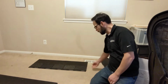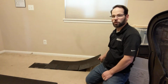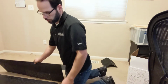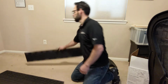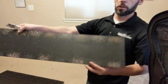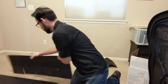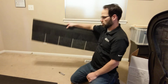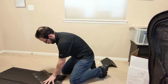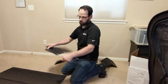They're the same length shingle. You don't want these seams to be lining up and overlapping, so you cut the first piece of starter so that they don't line up. And the amount that you cut is, so it's broken into 5 little sections there. You can kind of see the seam a little bit right here. And those correspond, of course, to the 5 tabs on the shingle. You want to offset it by 1.5. Cuts that easy.